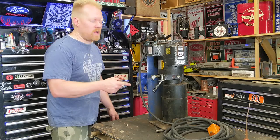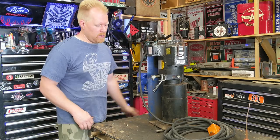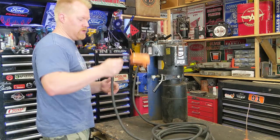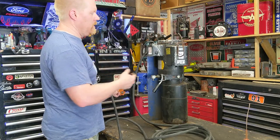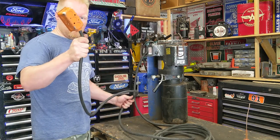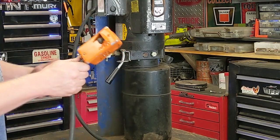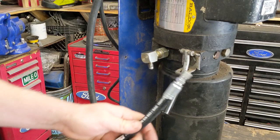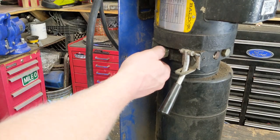This right here is the main hydraulic unit and I keep this just tucked away in the garage, plugged in. It just runs off 220. I did add a long push button — a lot of these lifts, it's kind of annoying to raise and lower them. There was a button on the machine, so I added a long cord with a little block with the same push button on it. Now I can get under the vehicle, look and position my blocks, and tap it up. The hydraulic hose connects right here going out to the lift.